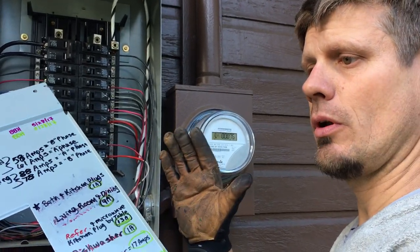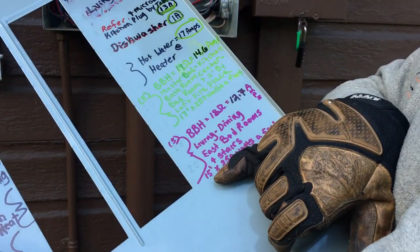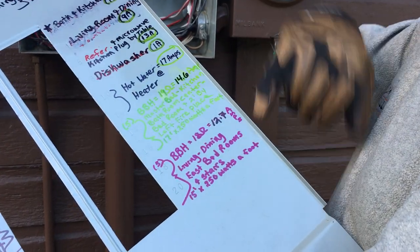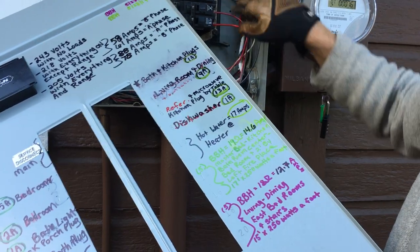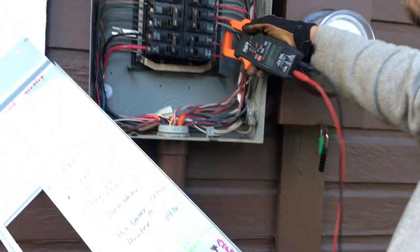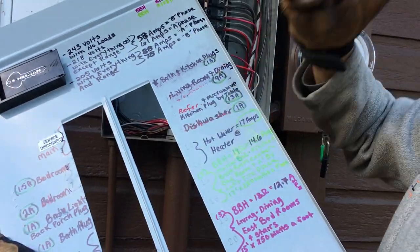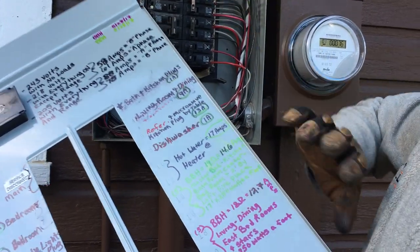A heater may be 2, 3, or 5 feet long but the element doesn't go all the way across — when you order them they're measured edge to edge. So you can apply the 80/20 percent value, or just say 12 feet at 250 watts, or 15 feet at 200 watts. Either way that's about 3,000 watts. Using a nominal voltage of around 230 volts, you get 12.7 amps — which matches my amp clamp reading. For 17 feet at 200 watts, you get 14.6 amps at 230V, or equivalently 14 feet at 250 watts — again an 80/20 value.